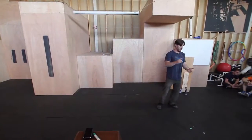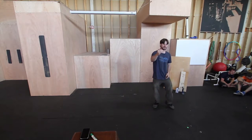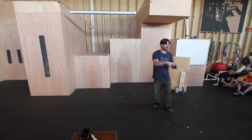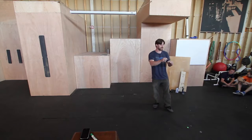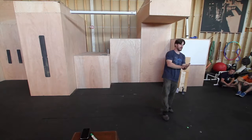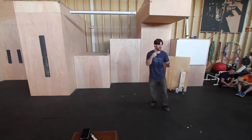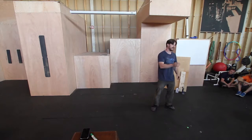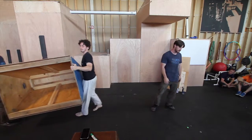My order of operations, basically, in terms of knocking out things that will break down over time, if you're working with wood especially: if you're nailing things together with no other connection points, nails eventually will start to pull out more and more and more. You can screw them together. It'll probably hold a little bit longer, but eventually the screws will start to pull out, right? You can glue them together with screws or with nails. What the glue will do is it cuts off the forces that act on the fasteners themselves, both the shear forces and the pull-out forces.